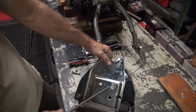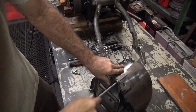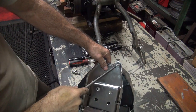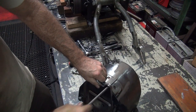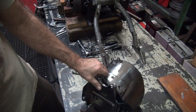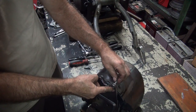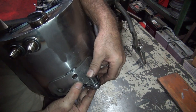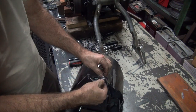So you're going to see where you are in the hole. I'm going at about a 45-degree angle to bring it more this way, and after you do that you go the other direction. I'm going to widen it out that way — makes the bolt fit real easy. Now the bolt has lots of free movement, so you can move it in all different directions. Before you couldn't move it at all the angles, you couldn't line anything up. So now this one fits correctly.